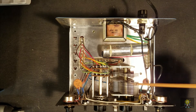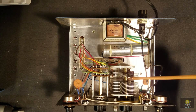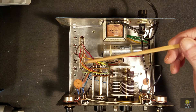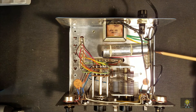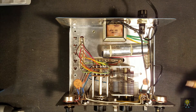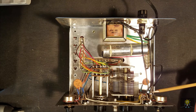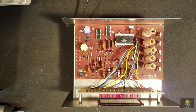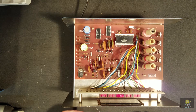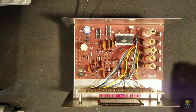It looks like there's a generic AM-FM air tunable cap here. The wiring looks fairly straightforward. If this was a kit, the individual who built it did a really good job of soldering everything. I think I'm going to bring this up on the VARIAC and we'll see if anything blows.